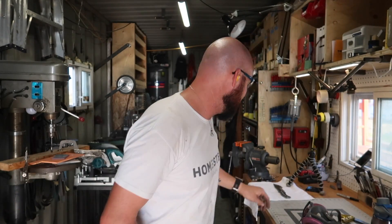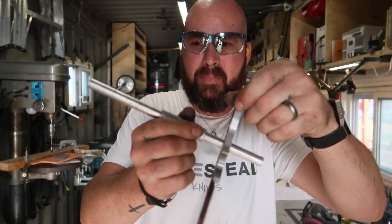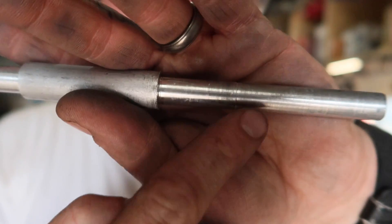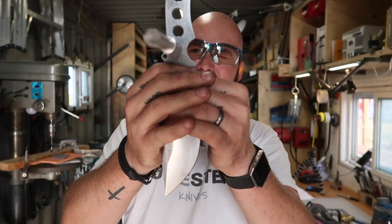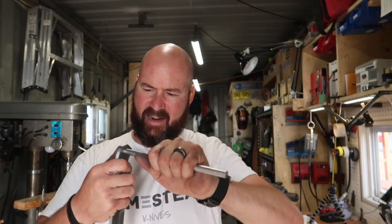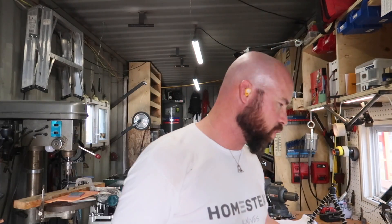This was the first side I had done, and it's interesting — when I check it to this hole it's a pretty nice snug fit, but in the other holes it's way too sloppy. I flipped it over, turned the other end down, and again not that great. There's a little step here — this end is a little bigger than this end. I think I'm going to have to make one spacer out of this part and another out of this part. These holes I've drilled are not perfectly concentric, or the aluminum isn't perfectly concentric. I'm going to part off pieces — making them one-quarter inch thick — then drill and tap right through. That'll wait for tomorrow.